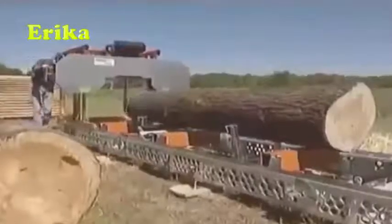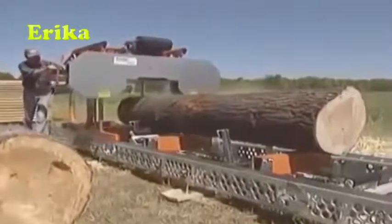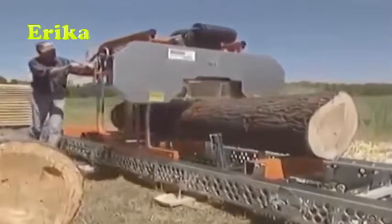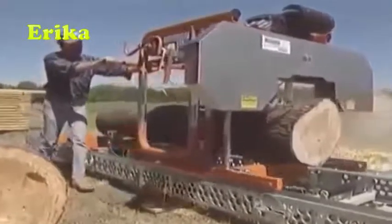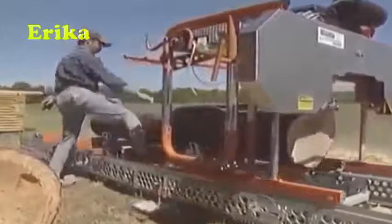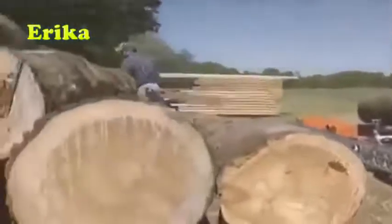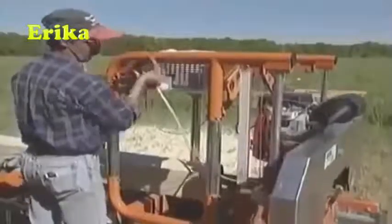A blade lube system is supplied to keep the blade and guides clean, cool, and lubricated. An automatic clutch is used so that the blade needs only to be moving while sawing. The depth of cut is made quickly by manually raising or lowering the counterbalanced saw head. A scaled indicator is provided to saw lumber to the required dimension.